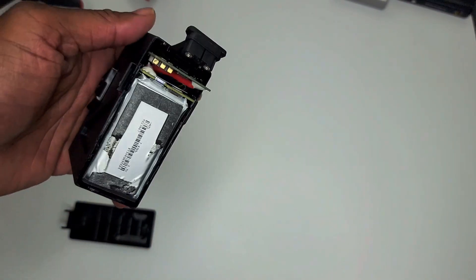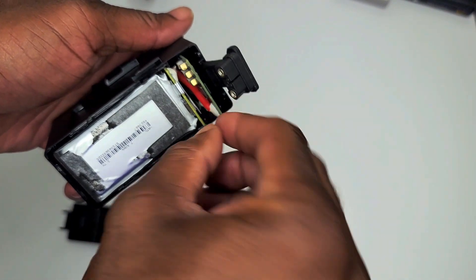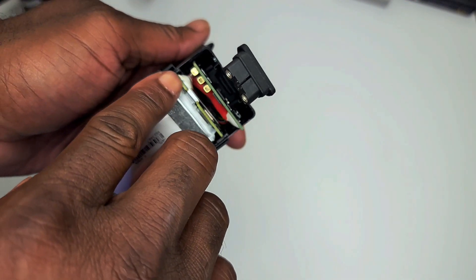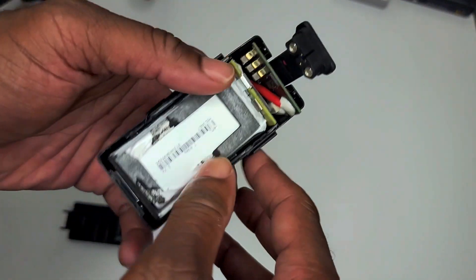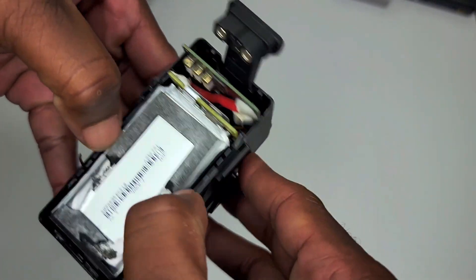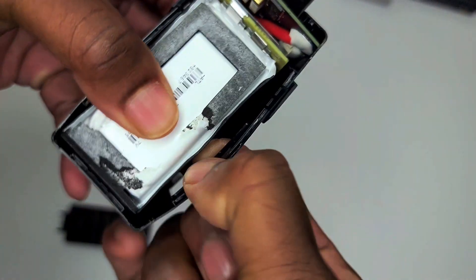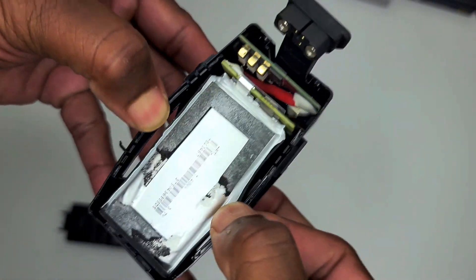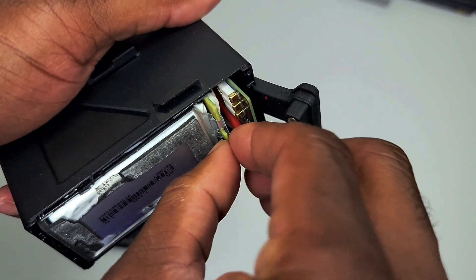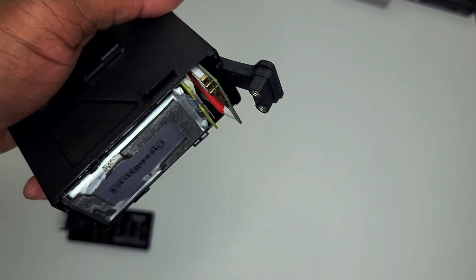You'll also have side covers — pieces of plastic stuck to the sides. Be cautious because the sides are hollow, so something could puncture through to the cells. There's no protection on the side except for that thin piece of plastic. Once you've got it out, you have the original battery cells, the power distribution board, and then DJI's proprietary smart battery controller — which has a power button. I can press it to show you it's still functional and powers right up.